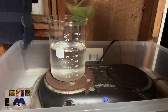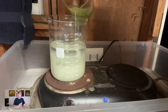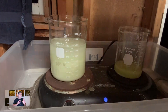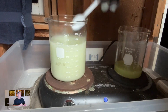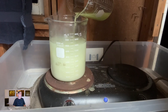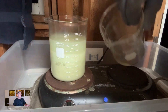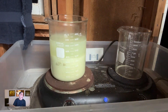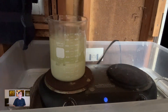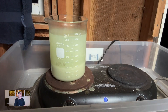If you're a refiner following along, always add acid to water — never add water to acid, especially sulfuric acid, because it reacts very violently with water. If you pour water into sulfuric acid it would flash boil, it would explode, it would be painful, it would be a mess. Notice how slowly I'm pouring it in. Look at the steam coming off — that is steam from the heat generated. It's near boiling, and I poured it really slowly.